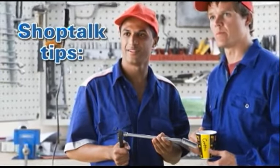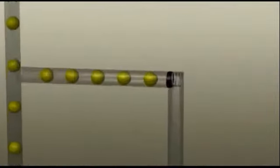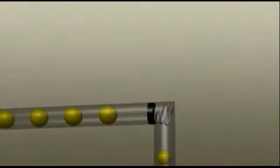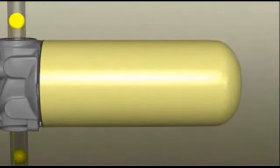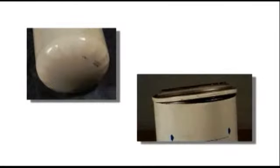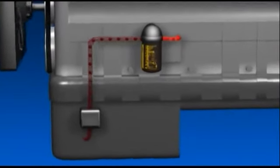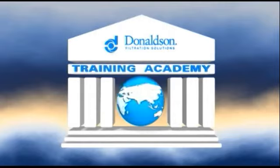Along with the service steps, here are some troubleshooting tips. This is a simplified engine lube circuit in normal operation with the pressure regulatory valve open and operating normally. Note that the pressure regulating valve in the lube circuit has become stuck in the closed position, resulting in much higher than normal pressure being exerted, causing the filter to dome at the end. Here is a photo of a filter doming because of excessive pressure built up in the lube circuit. Unnaturally high lube system pressures have inverted this tap plate. And this filter has developed a vertical crack indicating pressure fatigue. If you should notice any of these tell-tale signs of excessive pressure in the diesel engine lube circuit, it will be your opportunity to solve developing problems before additional damage is caused.